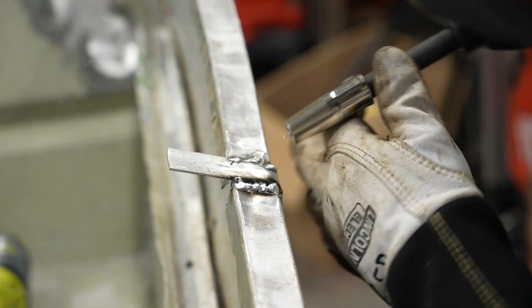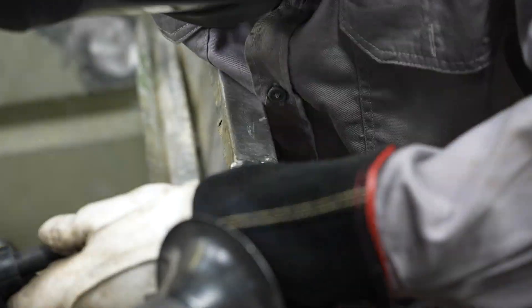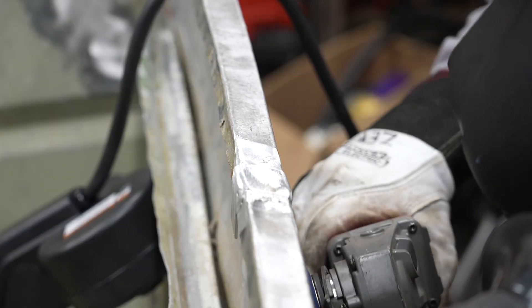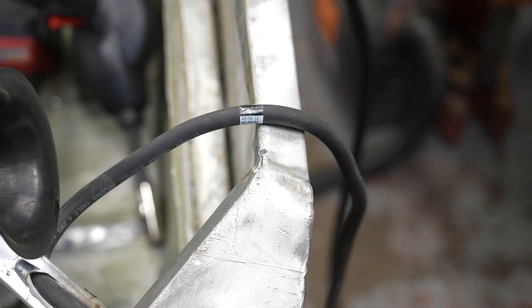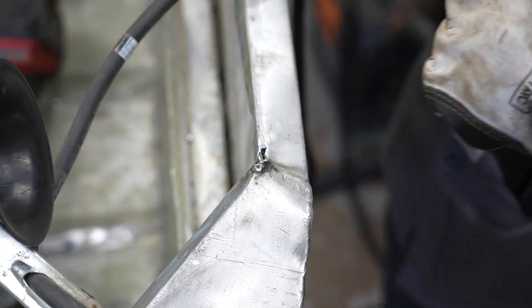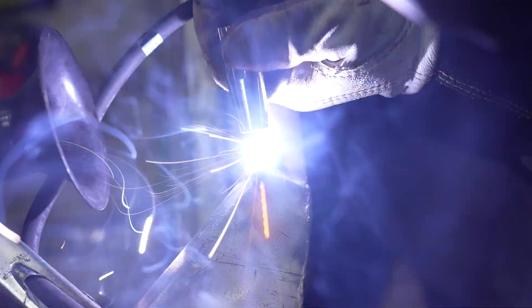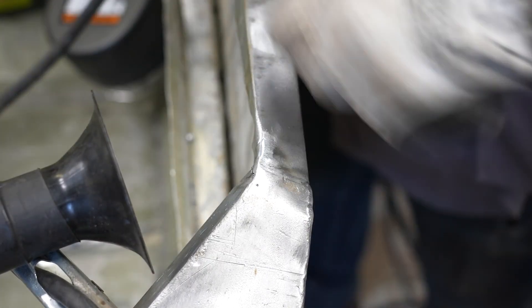I'm doing a little bit of dabbing as I go and trying to concentrate my heat towards that eighth-inch thick piece of good brand-new aluminum. I'm using a fume extractor just to try to get any impurities out of my face. I know I have a good weld because I just bent over that piece of aluminum with a hammer as I curved around that piece. I continue to weld and then go ahead and take the grinder to grind some of that material down. This isn't going to look super pretty, but I'm going for structural. Lewis is going to be sanding and epoxy painting this whole thing anyway, so he'll be able to blend this further after I'm done. I try to weld a little corner, do a little more burning through, so I back it up with a piece of aluminum — and I found this to be a really good strategy for welding thin stuff. I could put a piece of eighth-inch aluminum behind any holes and then weld from the top, sort of plug-weld it, and that would give me a nice base material to make a pretty decent weld.